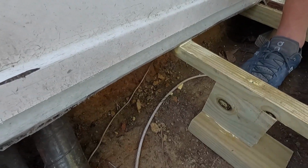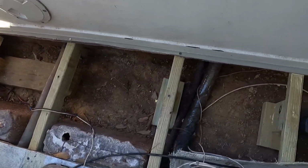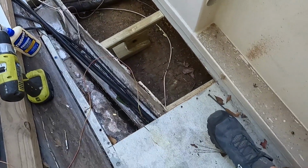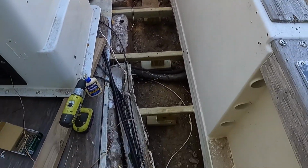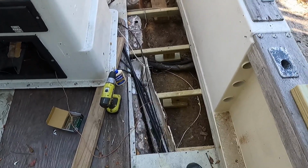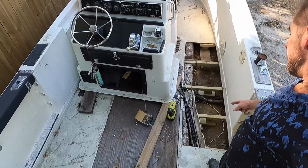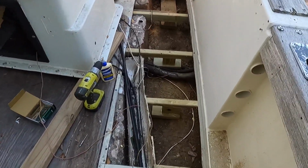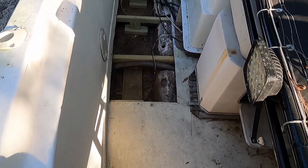And obviously I should have done clear coat before I built all these in here, but hindsight, you know how that goes. Anyway, I think our 5 braces are looking pretty awesome, and this is y'all in comparison. It's only like a 6-foot stretch, so maybe every 14 inches we have a brace. So I am super confident that if I could walk brace to brace without flexing any of them, when we actually have plywood on here, it's going to be super sturdy.